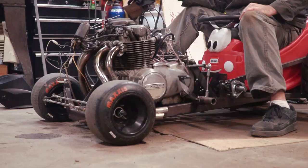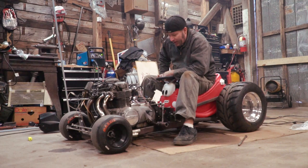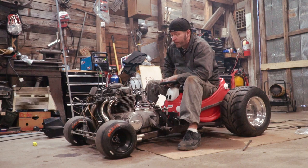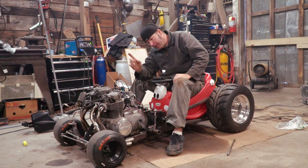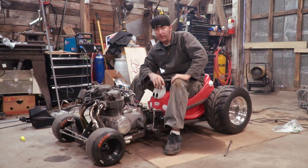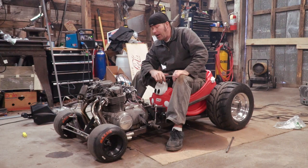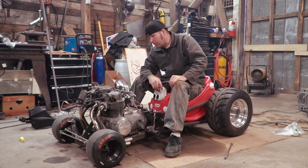That is awesome — it gets a little louder when you rev it up. Sounds like we still have carburetor problems. Well, she's also cold, so it might work better warm. It's going to like exhaust and it needs the pods — some filters for sure — and the mufflers. It's a two-into-one, so it might help scavenge. This engine has a redline just under 10,000 RPM and I bet it was about 7,000 to 7,500. This thing sings.